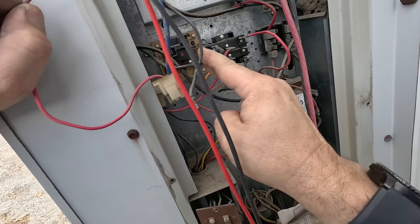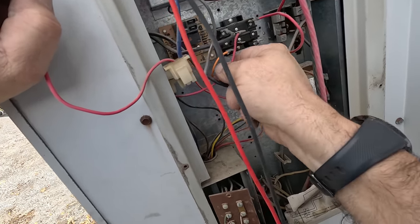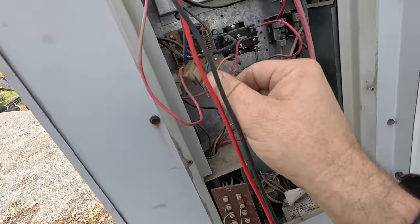That brown wire doesn't go anywhere - it's just a dummy terminal because they jumped these together. But that blue wire comes in and connects to - look at that - there's a wire there that fell off. I love digging because when you dig, things come apart. That goes to that contactor there. So that terminal goes to that terminal there on the contactor. When this thing shut off, it backfed high voltage to this relay on up. That's the problem right there.